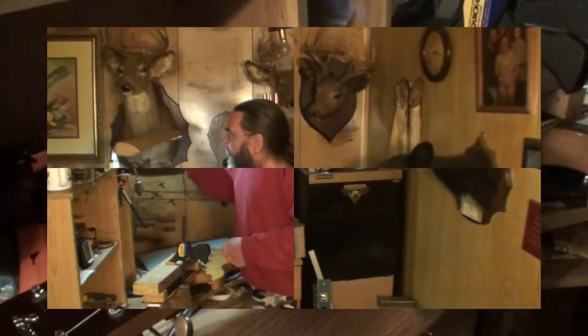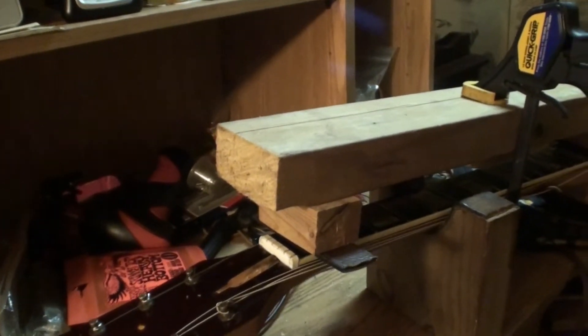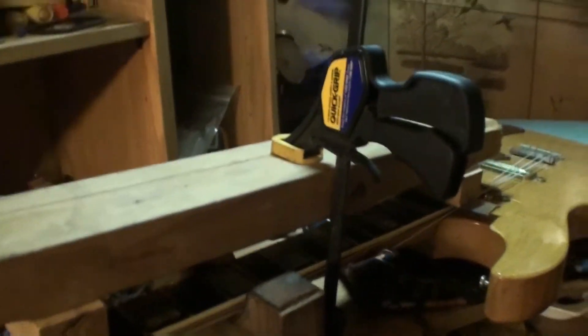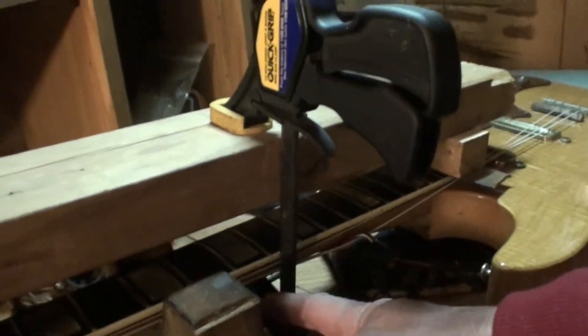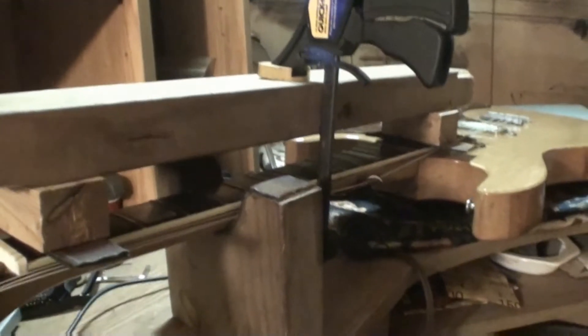Let me bring you over here and show you this horrible mess I've gotten myself into — but it's going away, it's working. So there it is in its majestic beauty — the wrench and the glasses and the whole thing. I never tightened this clamp more than maybe one more time after I put it on there. See what I did: I put a block here, a piece of leather, and a block, a piece of leather back here, and a block. I set this two-by-four on those two blocks, and by clamping it in the center of the neck, I'm forcing backward bow into the neck.